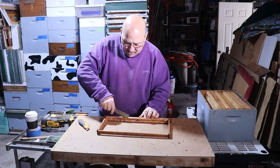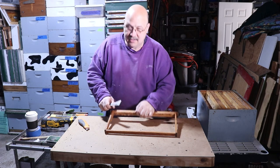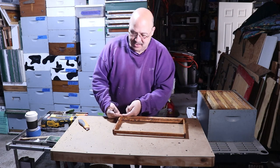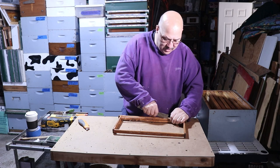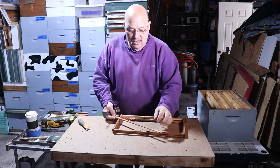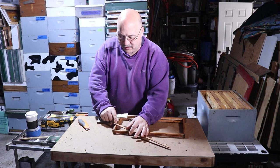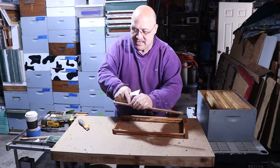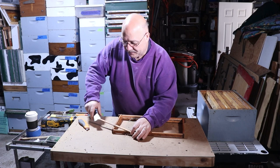I found the nail, loosened what's to this side, and I'm pushing it up — not trying to get it all out at once. Finding the second nail and pushing up to this side, just gently spreading it. If you get too aggressive it breaks the cleat. On this end, push it up and out away from the bar — if it's against the bar it'll break that end. Push hard and it pops right off. When it's down on the bar I set it on top of the frame, rest it on the corner, and give it a final scrape to get it clean.